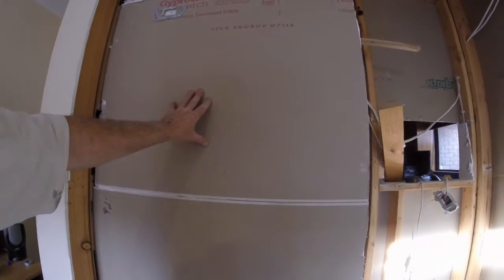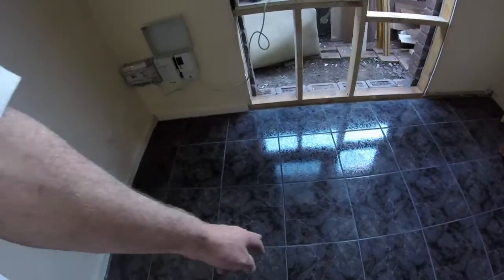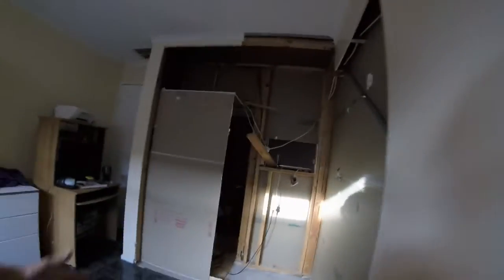We've got to take out this here and shorten it up a bit. This refrigerator recess plasterboard never really had a stud wall that it was fastened to — surprised it stood as long as it did. We're going to change that now and put a proper studded wall in. The new wall will run through to about this join in the tiles and then return to the wall. In this section will be the swinging door for access to the toilet, and the sliding door goes in here — the sliding door is only 800mm but with the cavity it's a total of about 1640mm. We've sort of ballsed up a little bit.